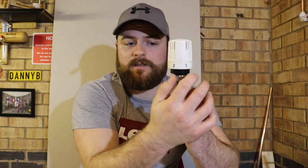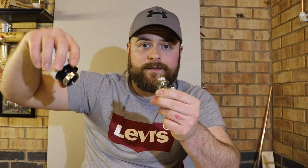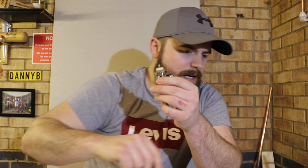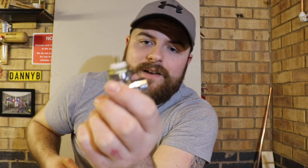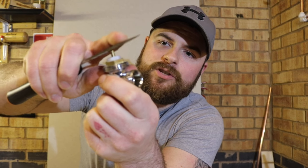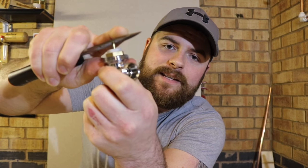You want to screw it there, just like so, and you can just pop it off — just like that. We'll go into what happens if they get stuck in another video. If you ever find that your radiator valve is stuck, you can take the head off and just lightly push up and down on the plunger. Now if this is stiff, this means that it's stuck, and sometimes you can free it up by doing this.